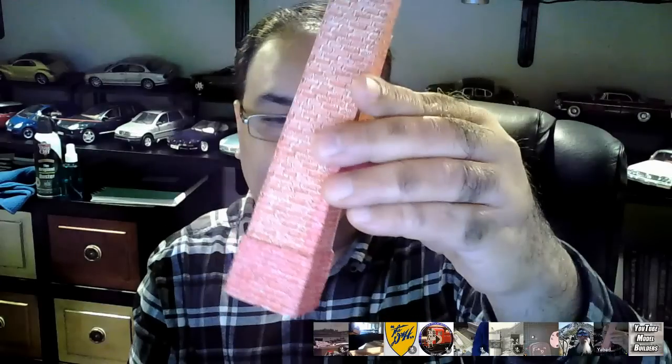His comment is, is the word transformer the correct term for a DCC power pack? No, it's not. Transformer is DC. When you go to DCC, you have a command module or power boosters. That's branding terminology. The reality is you're adapting AC power from your wall to DC, so it's more of a rectifier. Electrically, it's a rectifier. It's turning AC into DC power.